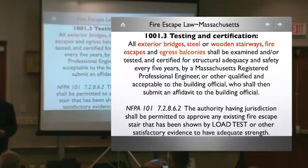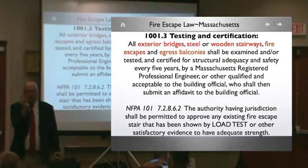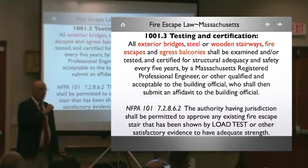But the piece that goes back into the building, which you can't see, which is usually 8 to 12 inches deep, full of rust, and any water coming from the roof down between bricks, in that half-inch spacing of the veneers of the main structural, guess what it's doing? It's rusting the fire escape from the inside out. And a load test will catch a connection in the building.